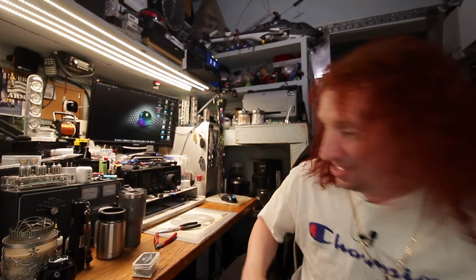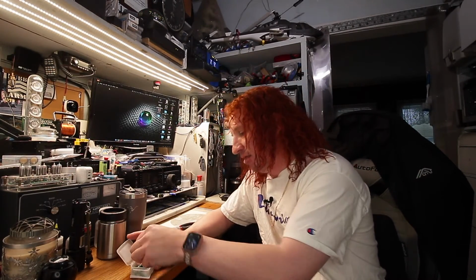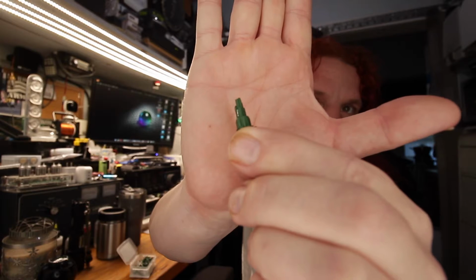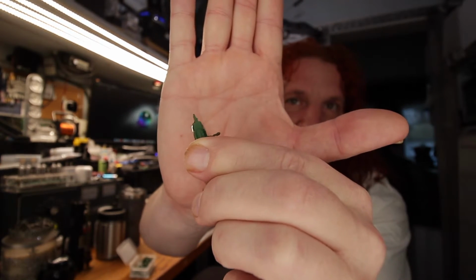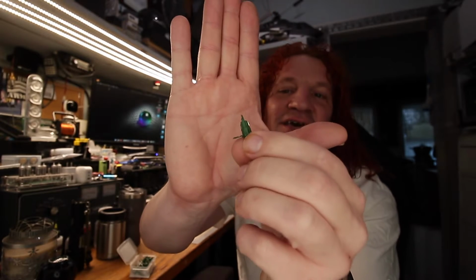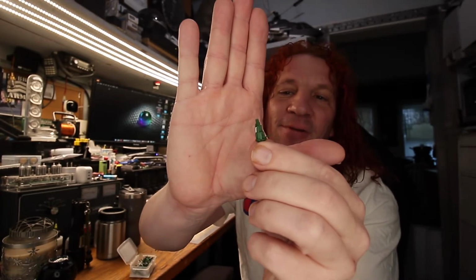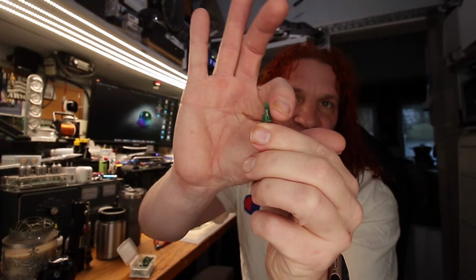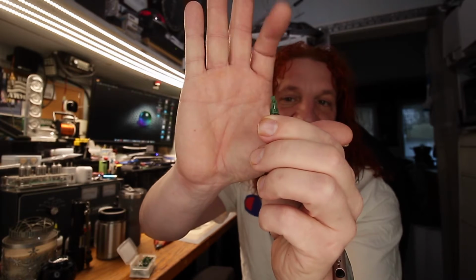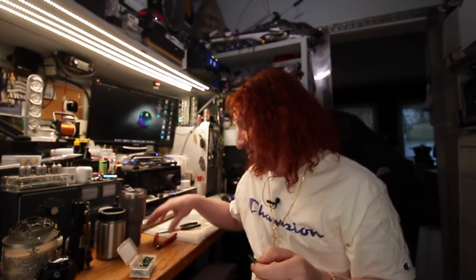So you've seen me whittle and probe and prod. To quickly review what I did on the bulb here: you see those little wires on there for the LED, and you see that extended piece that sticks up toward the top of my fingers. We're going to be cutting that off. Then it's a three-step process. The next step is there's a little bump on the front side of this thing, right here where my finger is touching it. We're going to be flush cutting that off. And then our final step is we're going to squeeze the base to shrink it up a little bit. This is a lot faster than having to whittle it with a knife. So, take your flush cutters and you're going to get right up on it.